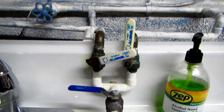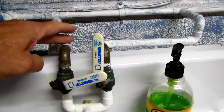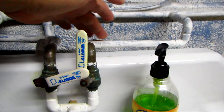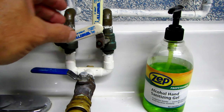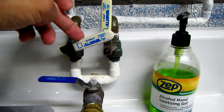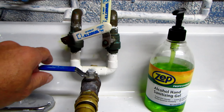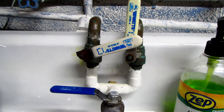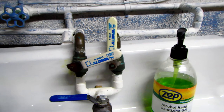Here's the system that I made. This one here is the hot water — it's half-inch with a half-inch ball valve. Here's the cold side, same thing — half-inch, half-inch ball valve. What I do is adjust the temperature like you would with your sink using the hot and cold, and then I open this up and check it. When it's the right temperature I just open it full blast. Fills up your tanks pretty quick and saves me a lot of time.